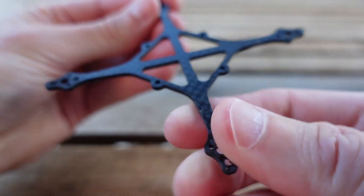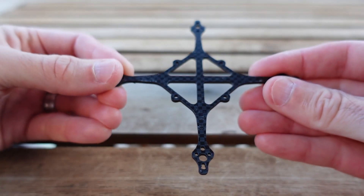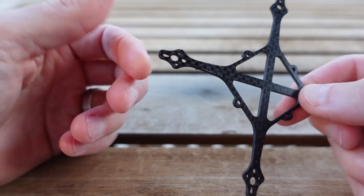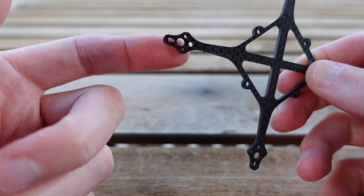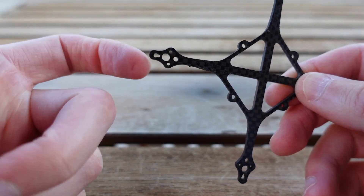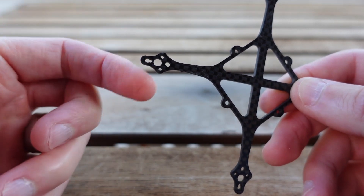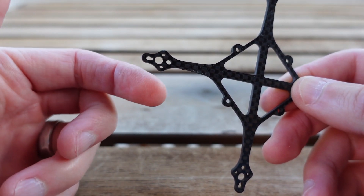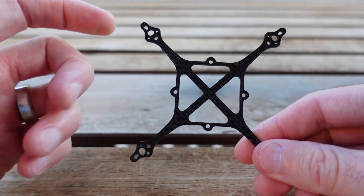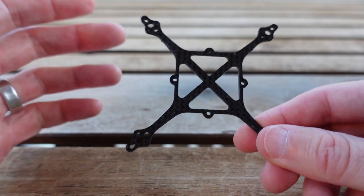Like all my frames, this is cut along the weave, which gives nice crash resistance. The motor mounts are fairly universal — there's a 3-hole M1.4 pattern and also an M2 size on a 9 millimeter rotated pattern. That will put the plug out at a somewhat awkward angle, but at least if you want to try something with M2 screws on the 9 millimeter diameter, you can.